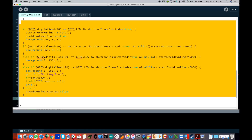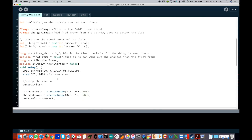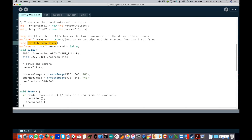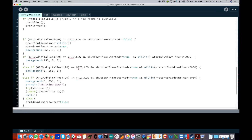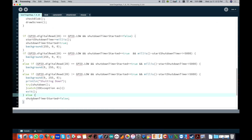In the void draw loop we've got new code that keeps track of when you're pushing that button, and if it is held down for over five seconds then on the release of it, it safely shuts down. Working through this: we read the pin — if it is low equal to GPIO.LOW and the timer is not running, we start the timer. We set that boolean to true, and I've got those defined up here as globals: a boolean for when the timer starts and a variable to store the current time. If you just tap the button the screen goes red.